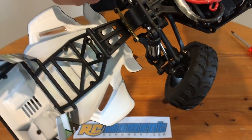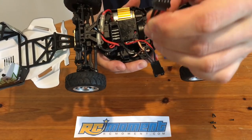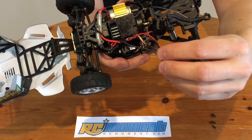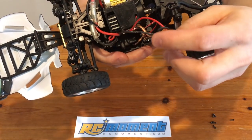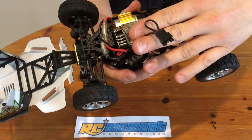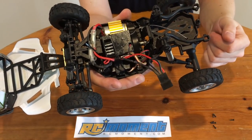The steering mechanism looks fine. I don't like this proprietary 4-pin battery connector — both cells are wired separately to the plug, and on the other side they are wired in series. So we could just chop off the plug and use a standard JST or T plug, which would allow us to use a standard 7.4V 2S LiPo.